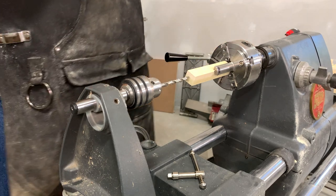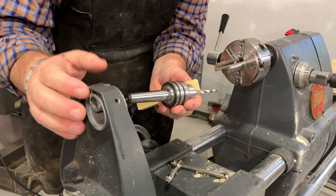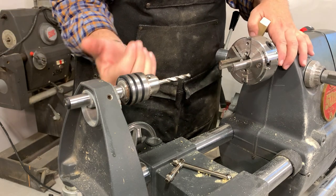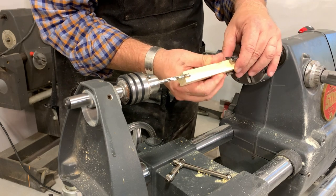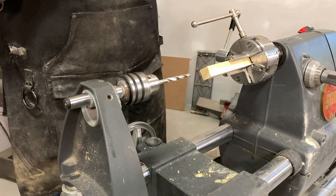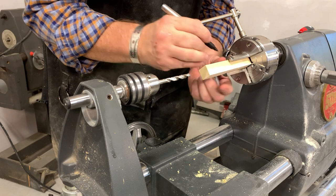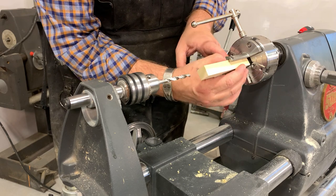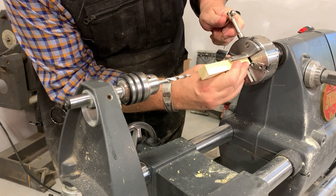Let's take our morse taper and stick it in. Make sure both surfaces are clean, because the chuck is held in by friction and it's possible it could begin to spin — so we'll keep an eye on that. I'm going to slide our stock in here. Before we go, let's make a mark to remind us which corner is facing the jaw. I'm pulling down against the V-block jaw as I bring it in and give it a little wiggle to make sure it's snug.